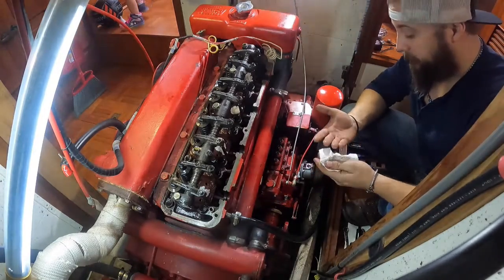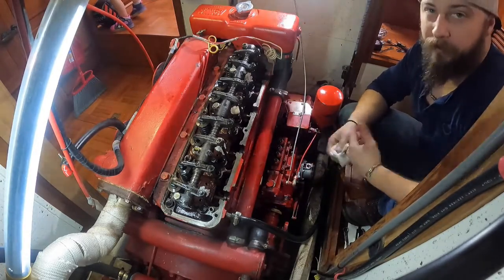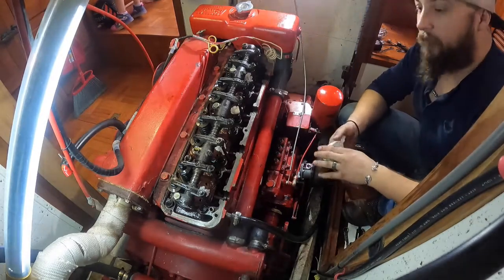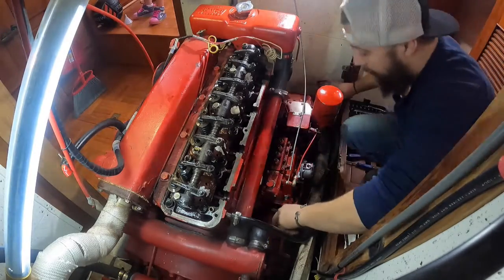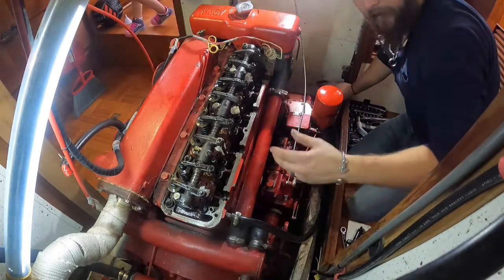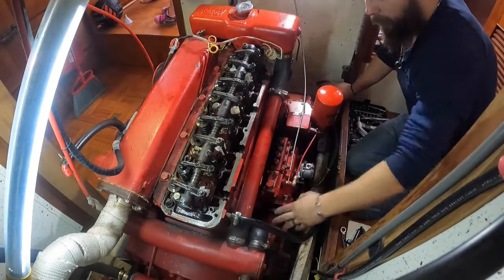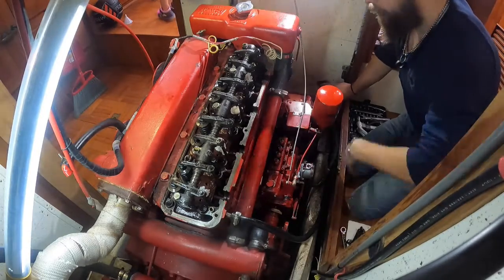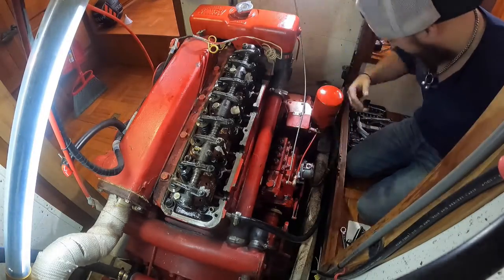This last time I was messing with the engine I got a weep coming from the seals inside the raw water pump. This is why I like to fire things up quite a few times — you want to get this thing really brought up to temp. Don't just pop it off and check for stuff; bring it up to temp, let it run, because when we first fired this it ran pretty good and now we're working out some bugs. Anyway, it's not a big deal to rebuild it and put new seals in — and this is a great time to do it. Everything's torn apart and I can just pop this off. If I were to save it for later it's going to be a little harder to get out. I'm definitely a big believer in while you're in here, just do what you can.